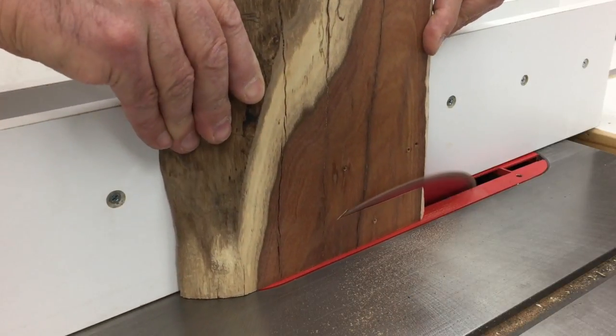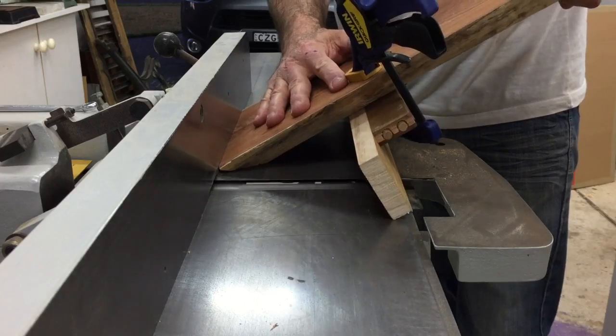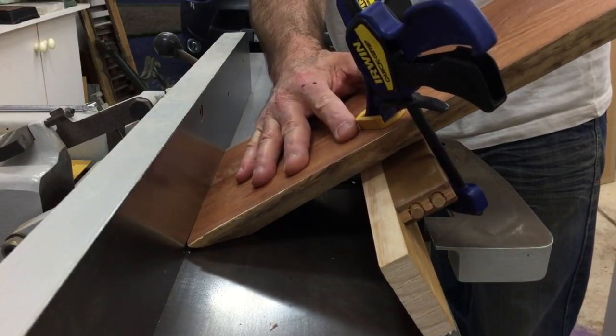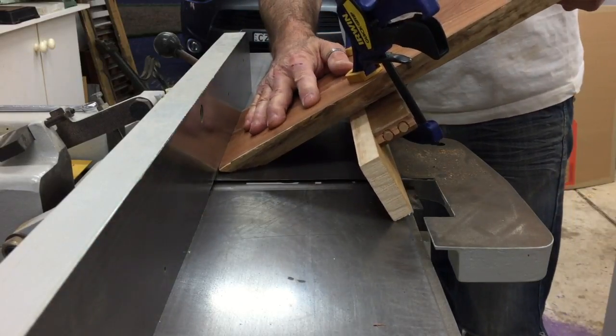When cutting end grain on hardwood, burn marks are inevitable, but trying to sand that end grain is almost impossible. So I set up this temporary right angle support piece, sized just right to allow the chamfers to sit flat on my jointer. Using the jointer to clean up those surfaces was so quick and easy.